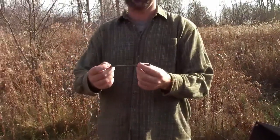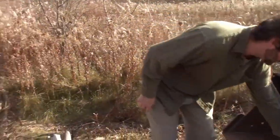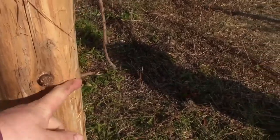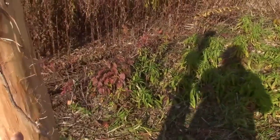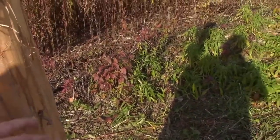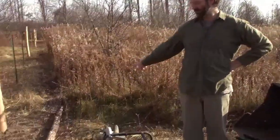Basically we've drilled a hole. We've got a short side and a long side. Basically, one side, we're drilling from outside right through the post, and the spike goes into the rail. The other side we are drilling just into the post a few inches and into the rail. So we kind of wedge it in and drill it all out. We will demonstrate. First we have to shorten up our rails.